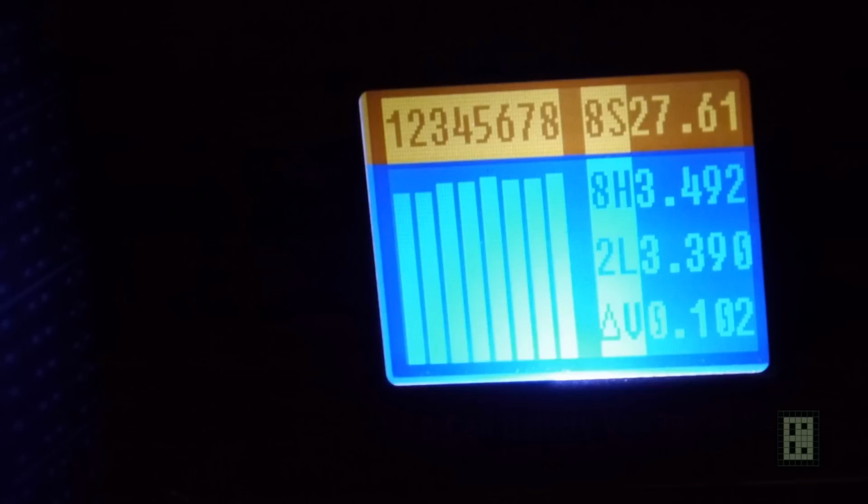And this is the cell voltages at the end of charge, and as you can see, it exceeded 100 millivolt. The alarm was set for 100 millivolt, so the alarm was working when I took this screenshot. So you can use this even to charge the batteries, since you can set an alarm for a delta between cells, and usually one of the cells will charge faster than the others, and at the end of the charge the voltage increases rapidly. So even if it's just 0.1% difference between cells, you will have one battery that will charge faster, so it will set the alarm on this battery meter.